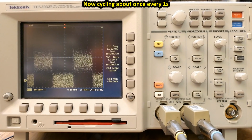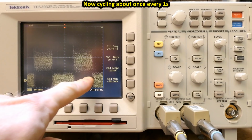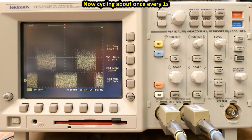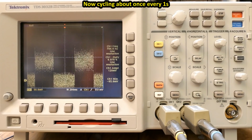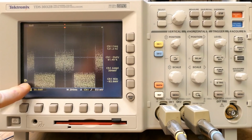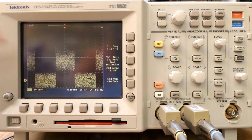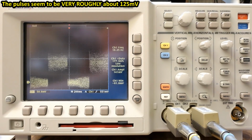And this is on the current sensing resistor. Now there is just one battery and there is the slow pulsing, but also quite a lot of noise. Does it come from the power supply or does it come from the oscilloscope? But let's just try to eyeball the voltage on it. This is the zero level, this marker, and this one, the center of it, is about 2.5 divisions above it. And this is with just one battery.